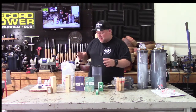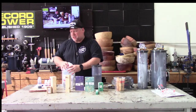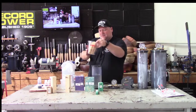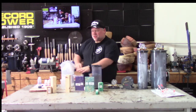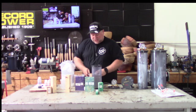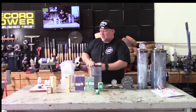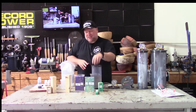So basically what I would do is mix the dye and the cactus juice first. If you're only doing 6 and they fit in this much, no problem, you could mix it up in that cup. That way you don't use your whole gallon. And if your chamber was big enough, you could set your cup down in there. The problem is you don't have any room above it, so that'd be your issue. With these chambers, it's easier just to put it in there.